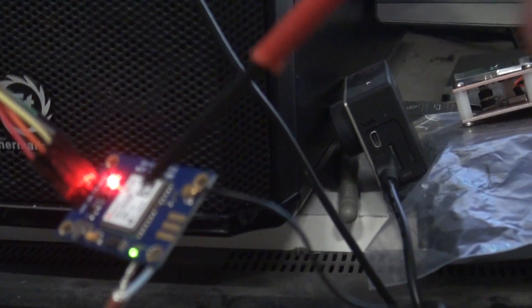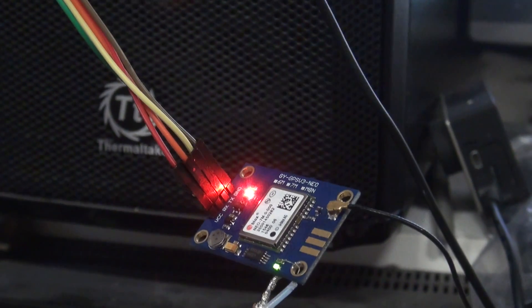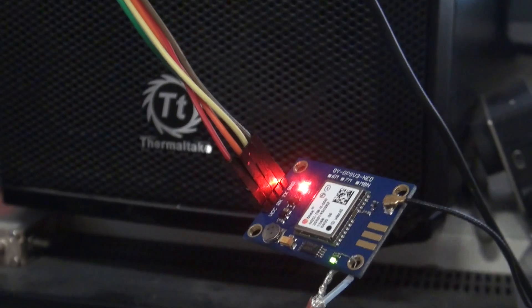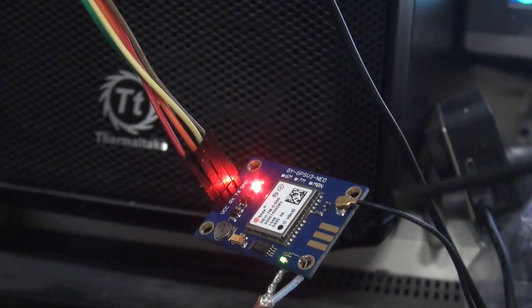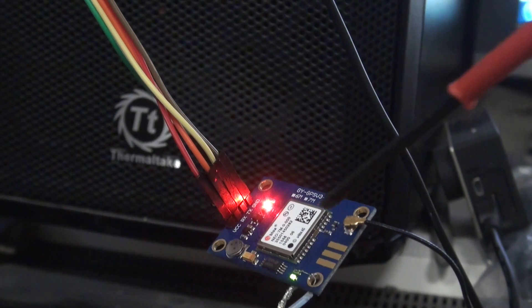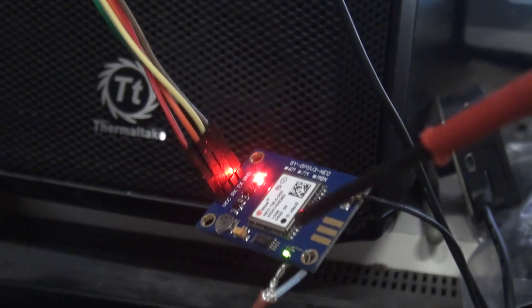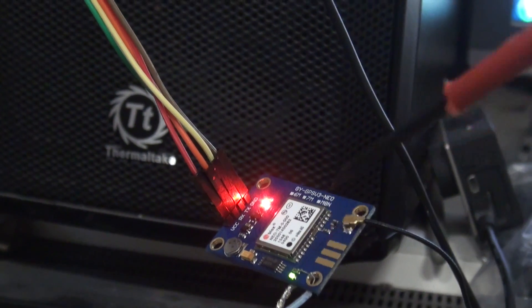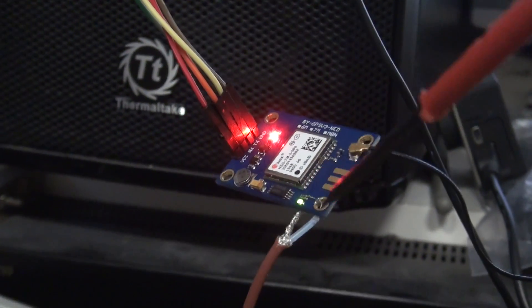To actually get the unit to output frequencies it's fairly simple — you have to do a simple mod. Basically, where that little green LED is, that LED actually flashes at the output frequency. At the moment that LED is flashing at 15 million times per second — obviously you can't see it because it looks like it's on all the time. So there's just a connection going from one side of that LED, or a resistor associated with that LED, to this little round ring here which is isolated from the rest of the board. That becomes your frequency output port, which is basically why I've got that coaxial cable connected to it going down into the counter.